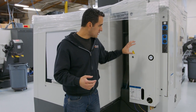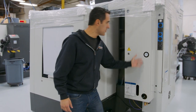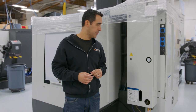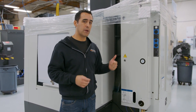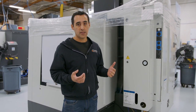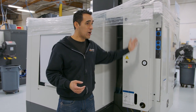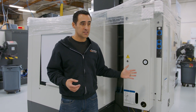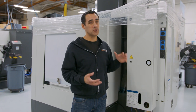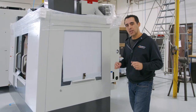This is where all the air comes in — air comes in at the bottom, there's a manifold up through there distributed throughout the machine. We use the manifold to power a lot of our workholding products and to tap in for any robotics we hook up to the machine. It's always good to know how many empty spots you have. Some older Haas machines don't have those manifolds or had smaller ones and you had to create your own. It's nice to know this design really hasn't changed.